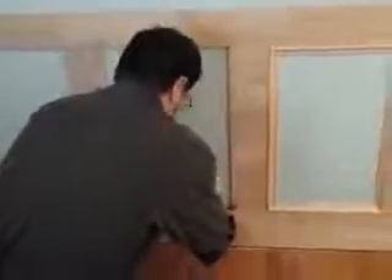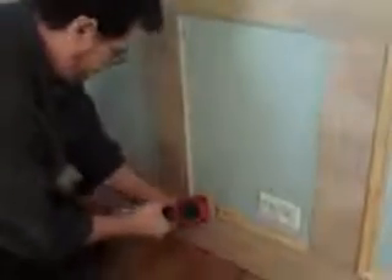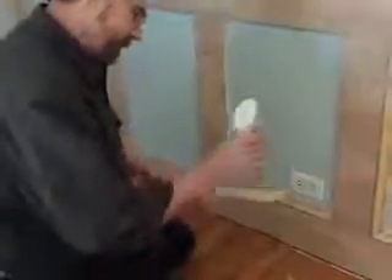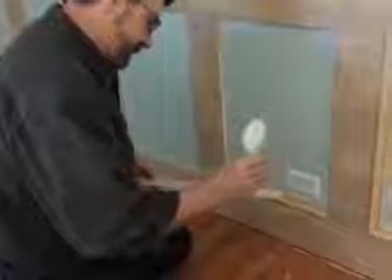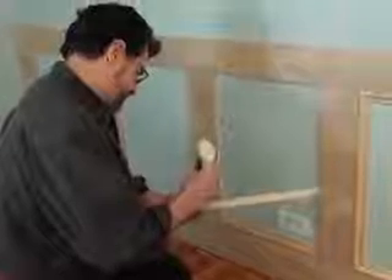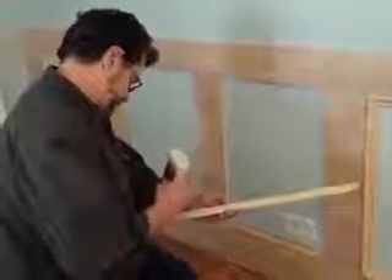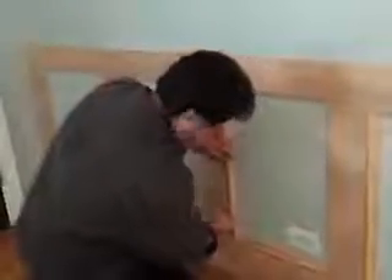As I was marking this panel and positioning it, I had this outlet right here. What I had to do was make sure it was in the lower part of the recess — I didn't want it to be right here, otherwise I'd have to extend the box. With these different projects, you've got to really look ahead. If you mess up, you might have to do it all over again or hire a contractor, which costs a lot more money.